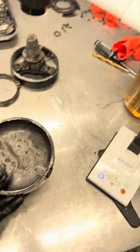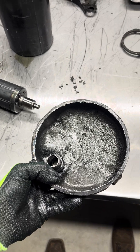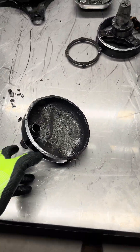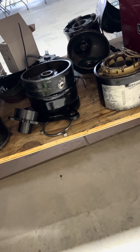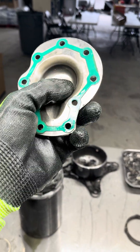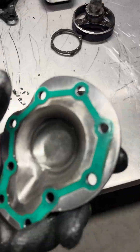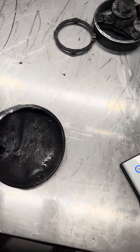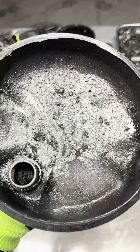One thing I don't like about LG's design is that there's no top pressure plate. When we talk about a top pressure plate on a Daikin compressor, there is a top pressure plate that comes out of the top of the actual compressor on the fixed scroll. Discharge gas comes out of the top of the compressor, hits the top pressure plate dome, and we just redirect it over at a 45-degree angle down into the base of the compressor. So the top of a Daikin compressor is somewhat of a low-pressure zone, depending upon mode, occupancy, and speeds.